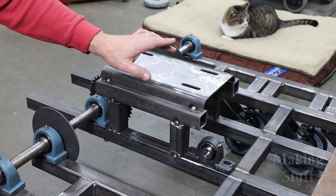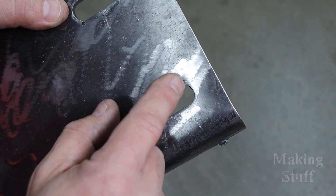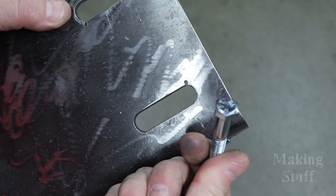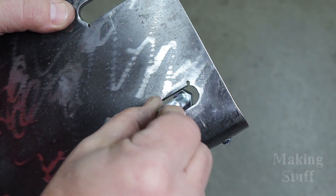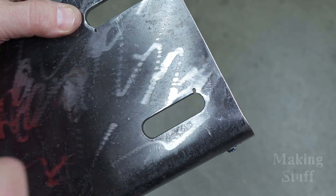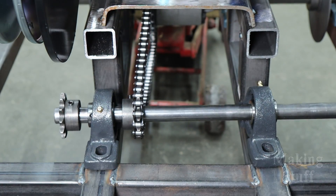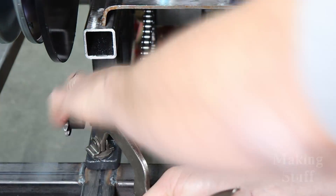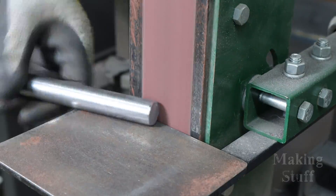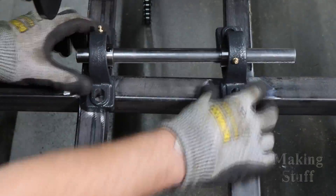Let me show you why I had to replace this top plate right here. Here is the simple mistake that I made. I had this set to cut on the outside edge of the drawing, and you can see right here where it pierced on the outside edge. Since it cut on the outside edge, it also made the hole bigger than what it should be. Here's one of the engine bolts and you can see it will pass right through — there's a lot more space here than what I intended. I could have used a washer and solved this, but I had enough material so I just decided to go ahead and cut another plate.